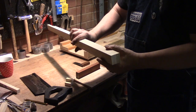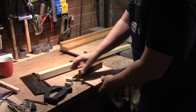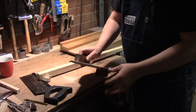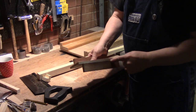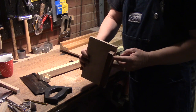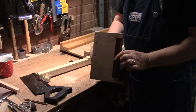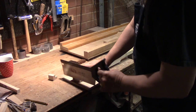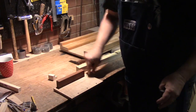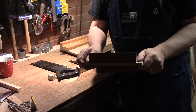That's it — a nice clean cut just using this very simple bench hook. All there is to it: a piece of 10mm ply and some scraps of neck blanks, glued and screwed on here. Probably about three-quarter by one-and-a-half inches, so about 22 by 35mm. It just stops short at the ends so you can use it left-handed or right-handed — just leave a gap of about three-quarter inch on the ends.